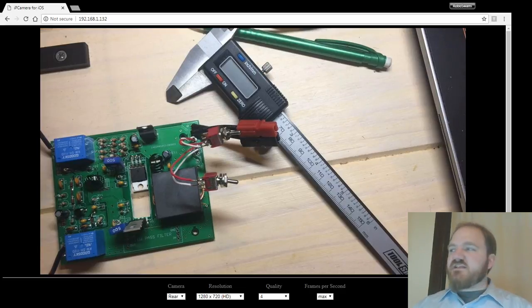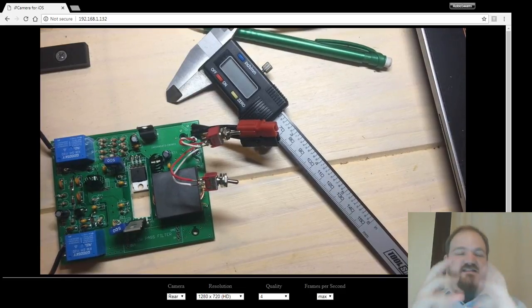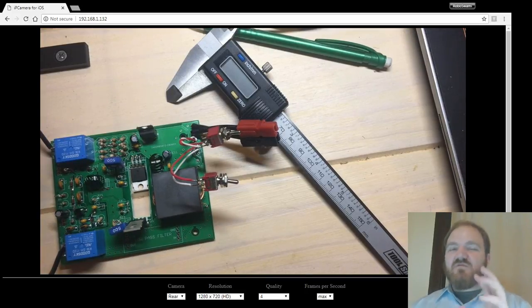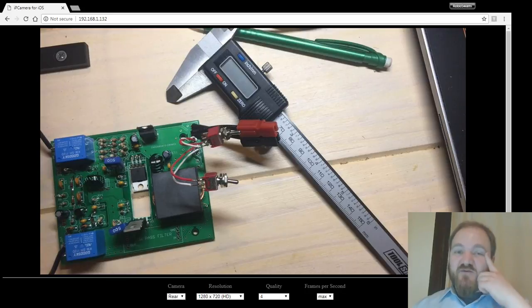So this is one of those things that I could make a parameter, because the depth of that box is going to be something I'm going to want to futz with, and making it a parameter would make it really simple. On the other hand, because we're only going to use that parameter in this one place, and we're going to reference other geometry to it rather than making it a parameter, I think it's going to be okay just to leave it as a parameter of this extrude. But I am going to name that extrusion.